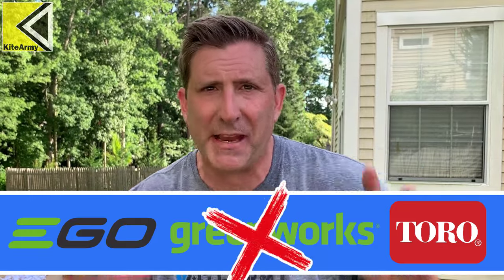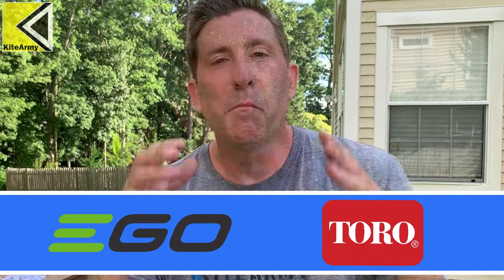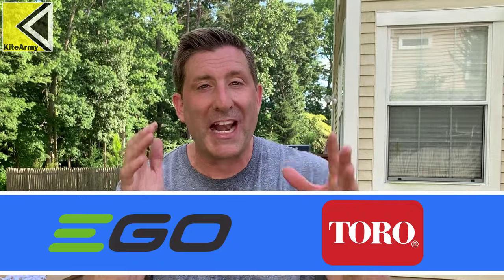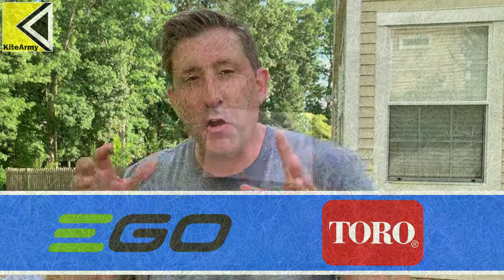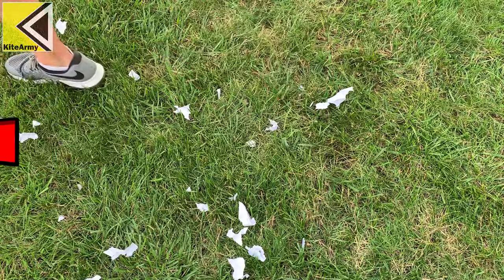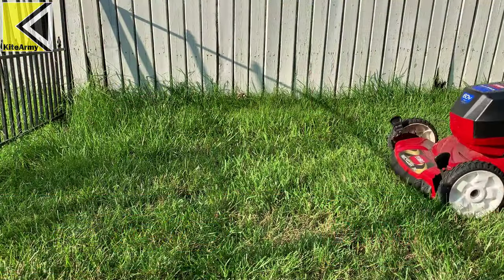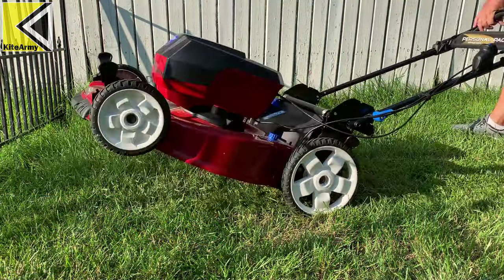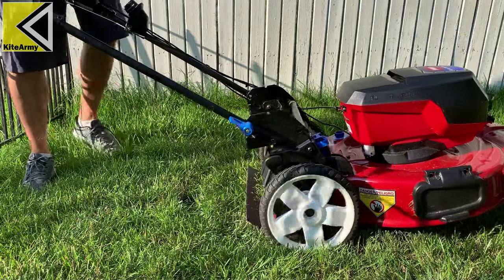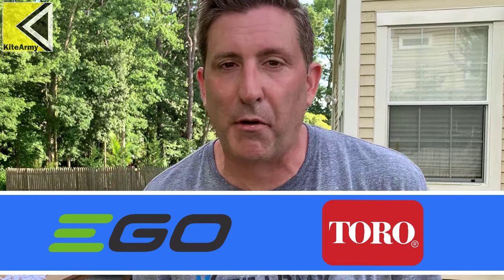First, let's eliminate the Greenworks — the pieces are huge, it's not even a contender. Now we're down to the Ego Select Cut and the Toro Recycler. Both did a really nice job of dicing that paper into really small pieces. The problem I need to point out with the Toro Recycler is that in the video it actually dragged the paper away from the camera — a lot of it was out of scene. Imagine mowing real grass and getting to the end of a row: when you lift the mower, all the suction between the grass and mower goes away and it dumps whatever's stuck to that deck on the ground. I think the Toro is using a lot of suction in that deck, which can be okay but can also be a problem.